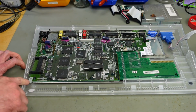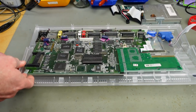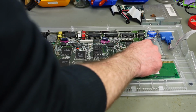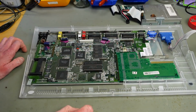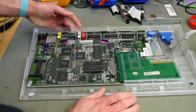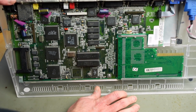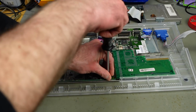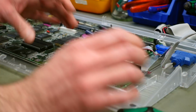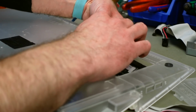So to remove the circuit board, there's one screw that's actually screwed in from the bottom side through the case and the shielding, and there's a couple of screws around the perimeter that are screwed into the casing here. And we also have to remove all the screws on the connectors in the back, I think, to get the bottom shielding off. Super fun operation. The accelerator card has to come away from the circuit board at least. It only ever really comes out the bottom.